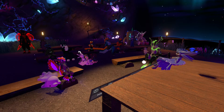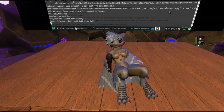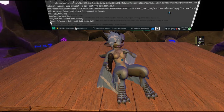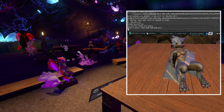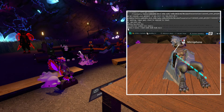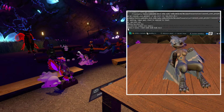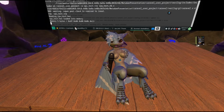Here's the thing, even if you have an FPGA, you still want to run the simulations. FPGAs behave very differently from integrated circuits in some cases, because FPGAs kind of cheat. They use lookup tables to look up a lot of the solutions to the logic that they try to represent, whereas ASIC chips actually implement the logic physically. So there is a difference, and you really always want to run the simulations, because, for instance, the latencies are very different. And yes, developing chips is a lot of just waiting for simulations to finish. Especially in the late stage, with the Commodore SID replica that I'm trying to make, the very last test I wanted to run was having it play an entire tune in the simulations, which meant simulating several minutes of activity, which ended up taking 4 real-life days to complete. So, yeah, lots of simulations.